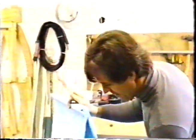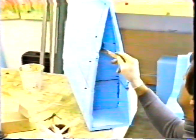Material in here. We'll be doing a layup in here later on in this sequence. It's about 2 or 3 days of work downstream, after we get the wing skins on and spar caps on. Not in that order, of course. Spar caps first, skins following. We'll be doing the shear web layup either tonight, immediately followed by the attachment of the leading edges, and then rejigging, and followed by spar caps and skins in one operation. This moves along very, very quickly.